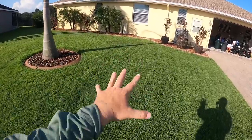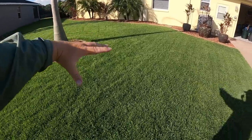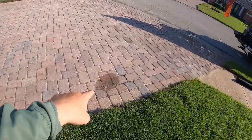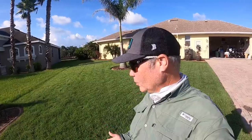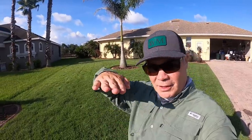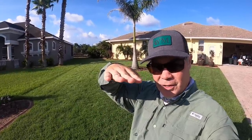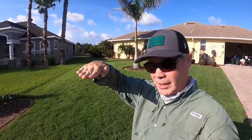This area right here is very low. And so what happens is the water ends up draining here, and then it comes over here, and it goes across my driveway, and it disturbs my pavers. Now, the other reason I want to fix it is because when I mow, it ends up scalping some spots. We're not going to go into that too much today, but basically, if you have an area that's low and your mower blade comes across it, when your mower blade hits the low spot, it actually makes a higher cut. And when your blade hits the high spot, it makes a lower cut,